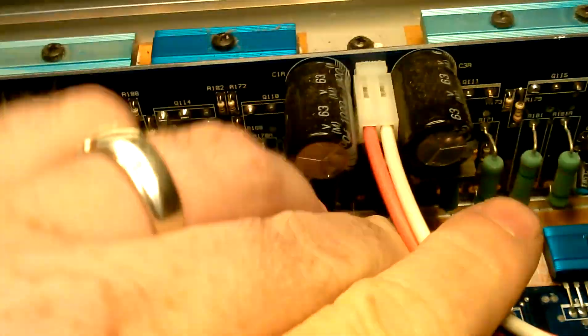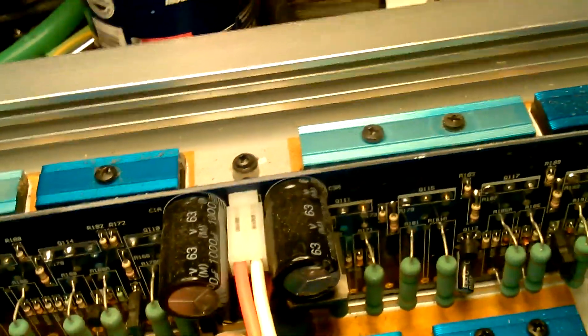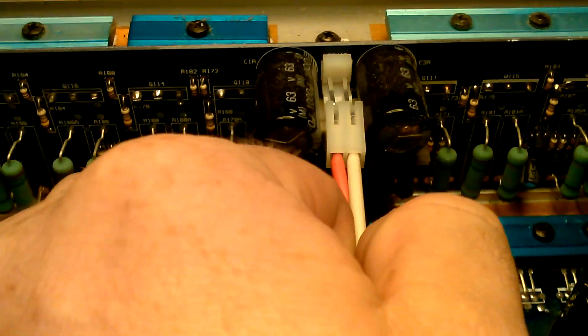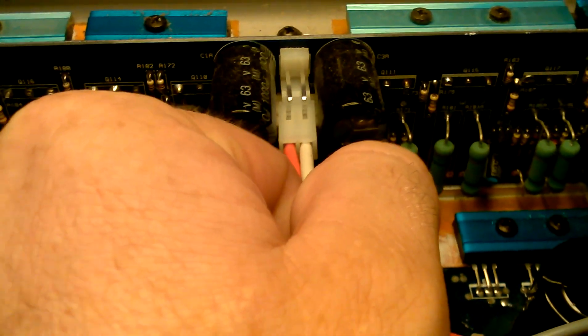I just want to warn you guys. These here are the high voltage connections, and you have the preamp side with low-voltage wires — that's fine. But they seem to want to connect high voltage and high current with these connectors, and these were removed just by my fingers that easily — not even locked in. I guarantee if I loaded this amp down you'd see little sparks in there. That happens on both sides.